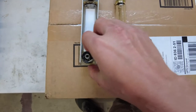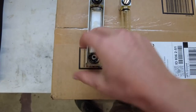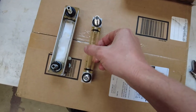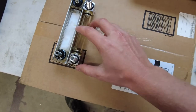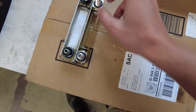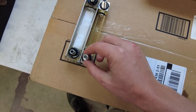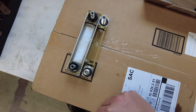As you can see, it's got these injection-molded end caps and a center tube. Not altogether different than the new one, but this one has aluminum end caps and the spacing looks correct. What I am noticing, even though I got this part number from a guy online, is that these bolts are a lot bigger. I'm going to experiment and see if this fits, but it looks like I might be drilling out those holes.